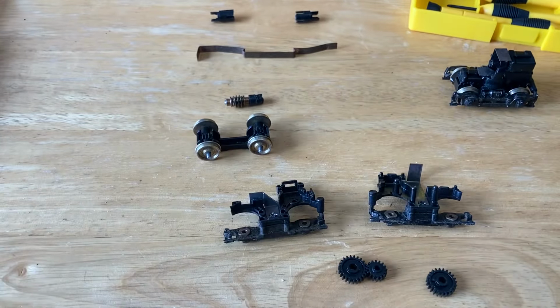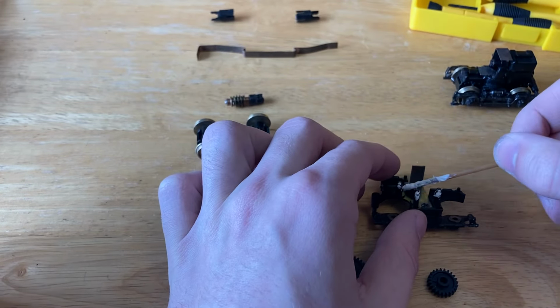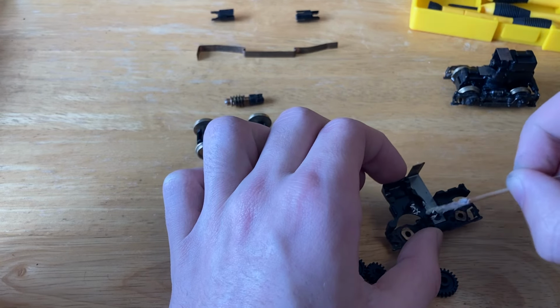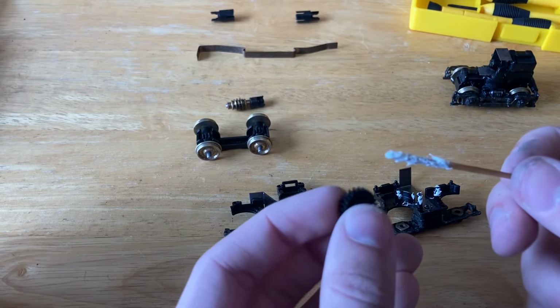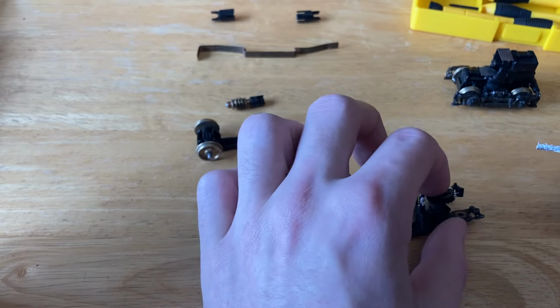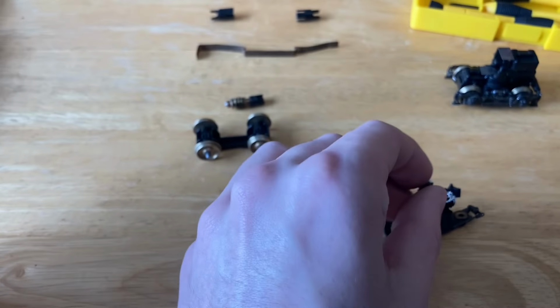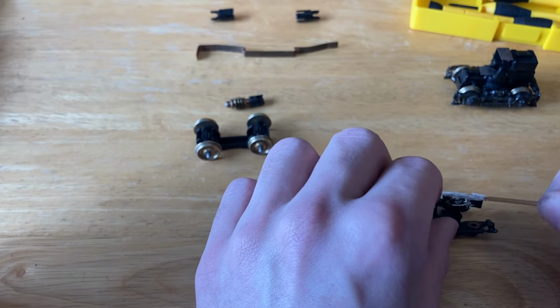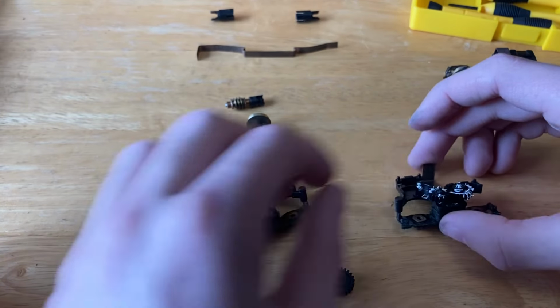And it's time to add my own lubricant or grease. This is some lithium grease. Just going to take some and put a little bit on each post. So a little bit on the back wall in case they rub up on that. Each gear, I'm just gonna rub on part of the teeth. If the engine runs around, it should spread about pretty easily. There we go.